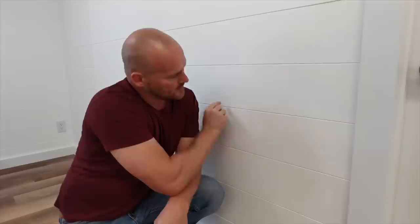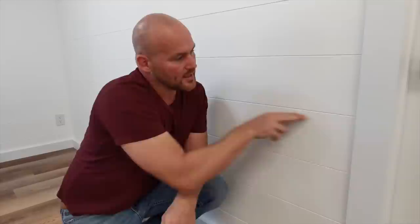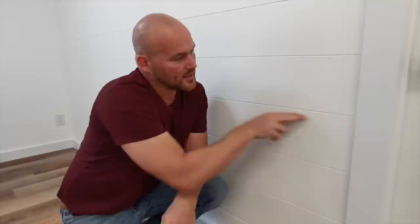Here's the finished product. We ended up putting three coats of white paint on here because what we painted in the cracks was showing through. It turned out quite nicely. For the casing and trim we used a high-grade one-by-four, which has nice hard edges to go with it, then caulked the edges, touched up our final line, and cut it all in nicely.